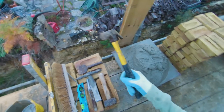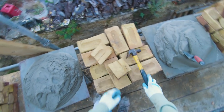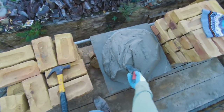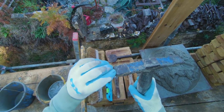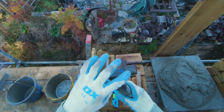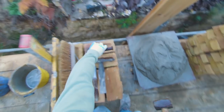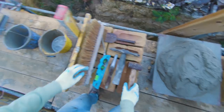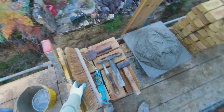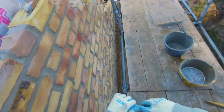A jointing iron for once you're done, to rub it all up with. A hammer — in this case I'm using half-bat bricks so I use a hammer to break them in half. This is called a scutch hammer: it's got two little slits in either end and you can put different pieces in — this is a chiseled scutch, but you can also have tooth ones. It's essentially a double-edged brick hammer. Also a hammer and bolster in case you want to cut a brick more precisely, and a brush to brush it over after jointing. And of course the weapon of choice — the trowel. I use a Marshalltown 1911 Philadelphia pattern trowel.